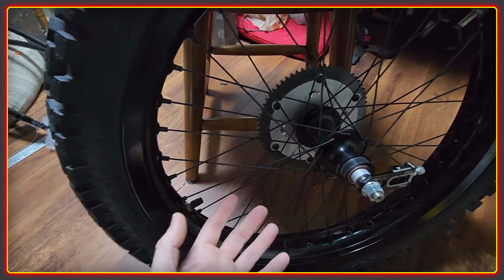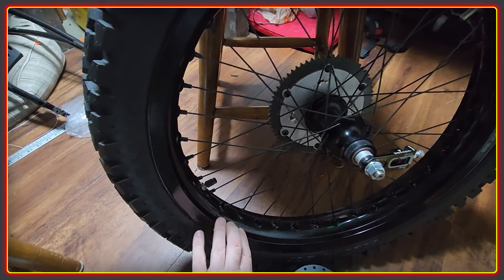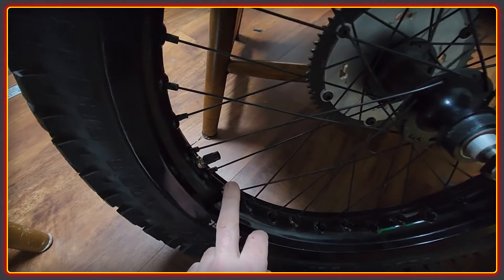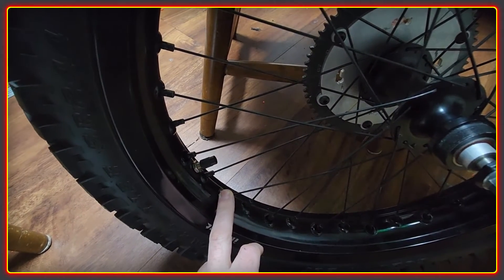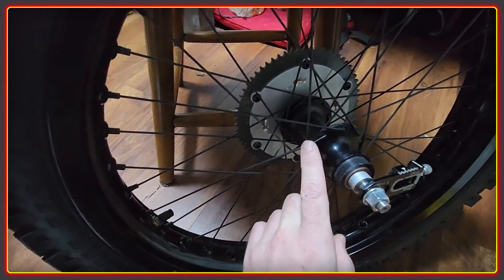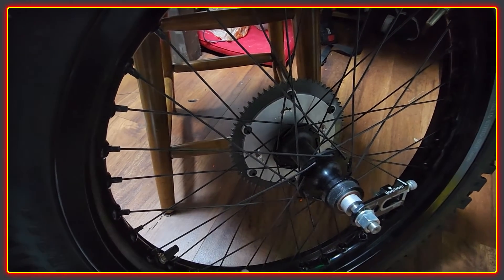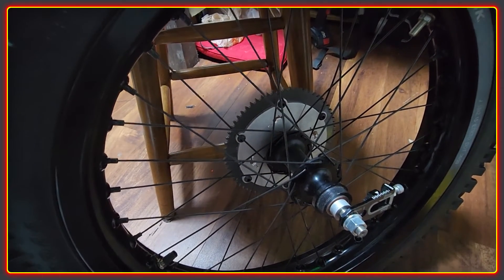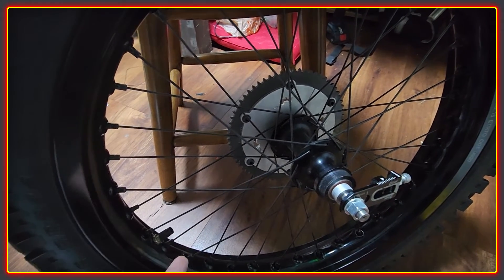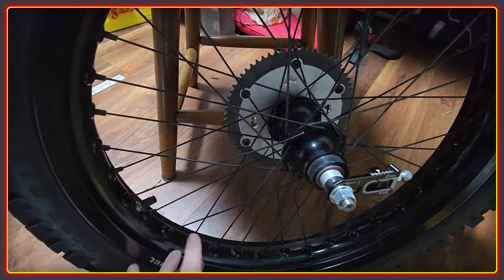It's not really what I want to do. What I want is a motorcycle rim with a reasonably light spoke that will still fit with standard motorcycle spoke nipples. To make this possible, I need to have control over the design of the hub. I've spent ages trawling the net looking at different options and I've come to the conclusion that making a hub won't be cheap, but it's not going to be any more expensive than trying to shoehorn in a component that's not really intended to go there.